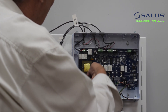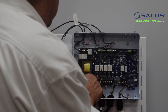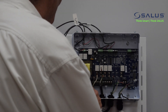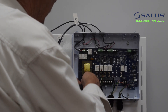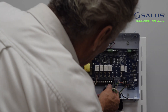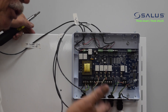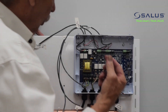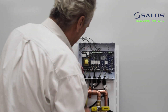Power to the unit is now in — a good solid setup. The next step will be starting to hook up the pumps. On our particular unit, if you want a priority pump — for example, if you have domestic water or certain heating zones that need priority — pump number one will be your priority pump. Line voltage again will be black.